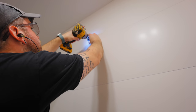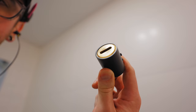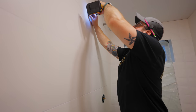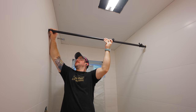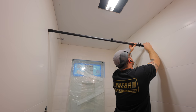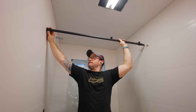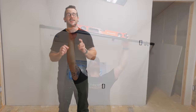Once the hole was drilled, I got the bracket mounted to the wall, although the included screws were a little bit too short, so I swapped in my own screws. The hole in the mounting bracket is slotted to allow for some adjustment — depending on how you orient the bracket, you can make adjustments up and down or side to side. I repeated the process on the other wall, then unthreaded the brass plates from the bracket, slid the brackets onto the rail, and reattached the brackets to the plates to get the rail mounted. After mounting, I checked the rail for level and made any necessary adjustments. This part was definitely a little fiddly, and a second set of hands would have been extremely helpful.